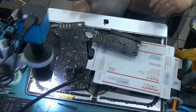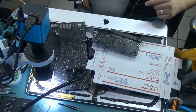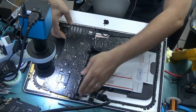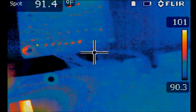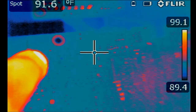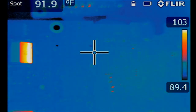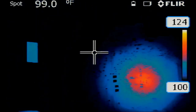I have this board under the power supply because I do not want the power supply to touch anything else on the bottom — I don't know if there's anything conductive under there, so I'm separating them with cardboard. These are the boundaries of the motherboard, and I want to look at this area here that was getting hot yesterday. That shiny spot is not a heat spot — if you tilt the board it goes away, it's just a shiny object. We're interested in the area that got hot yesterday.